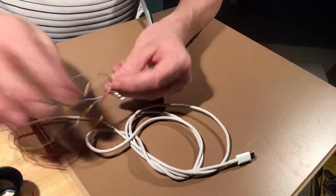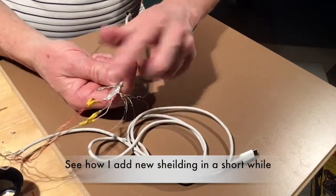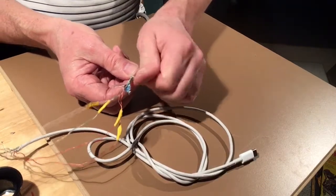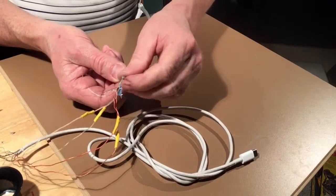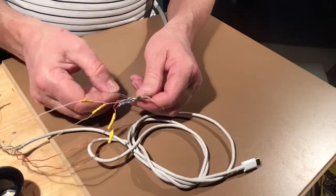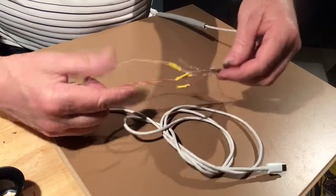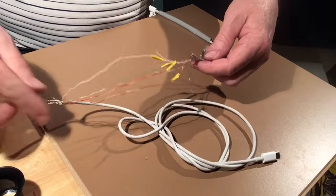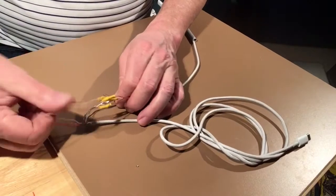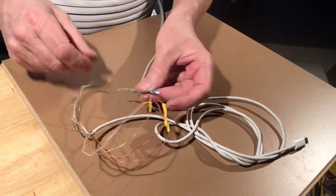Now we've got these braided cables. We have this shielding, which was wrapped all the way down everything. And we have this protective, not dog-proof shielding on the exterior. So we're going to hook up the braiding to the braiding. This is where that extra looseness comes in, because I'm just going to more or less solder them like this, then fold it to fit. So I'm just going to tin the ends.